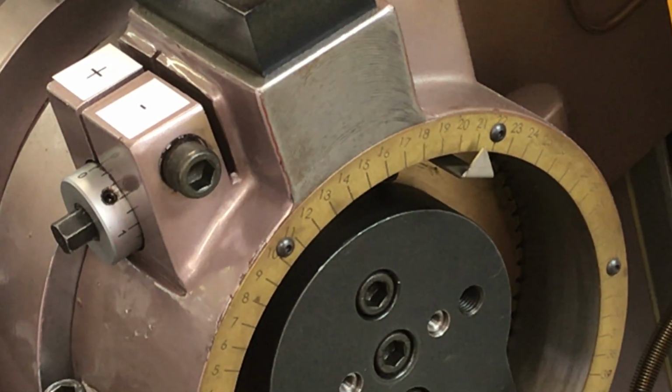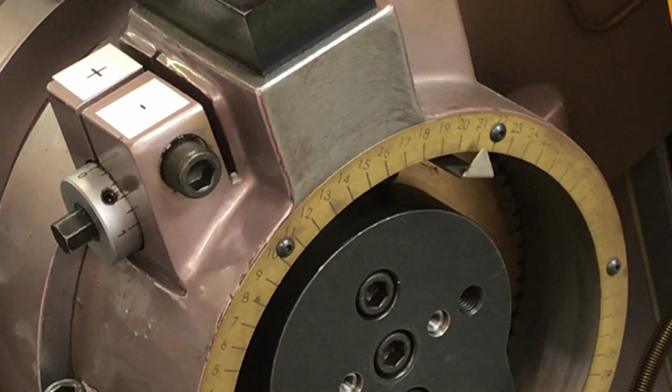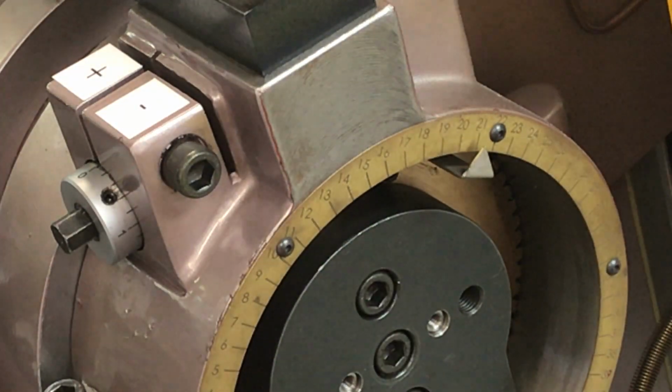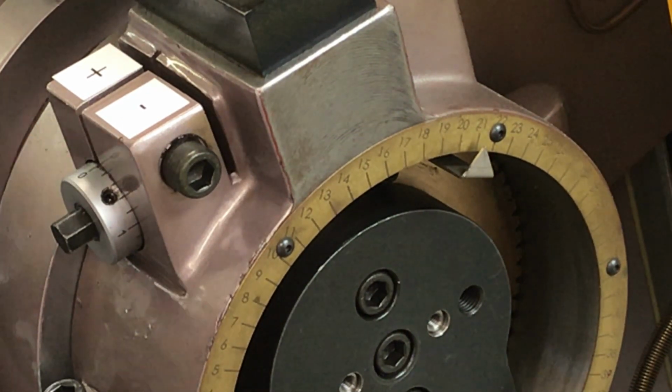I'm here at the lab today working with the Crest Clamshell to demonstrate the impression adjustment on the Crest. Now we go from 0 to 44. We're currently at 21. Now 21 is the 0 point for 937 dies. So I can put a 937 die in the press, and at 0 and 21, the press will not die cut.